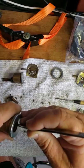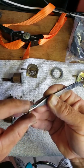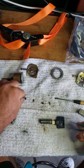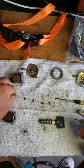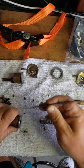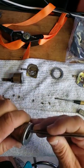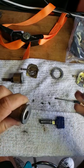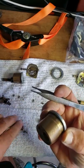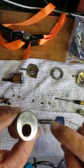Getting back to our lock here - here's the second pin, that one still has some spring to it and the pin doesn't look too bad. We'll spread this out a little farther, pull this spring out. That gives us the last pin which is already out, so we've got an empty shell right now. We're going to clean that shell up - there's the housing and you can see the pin chambers there.